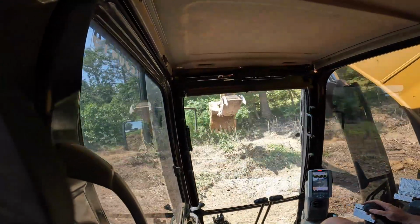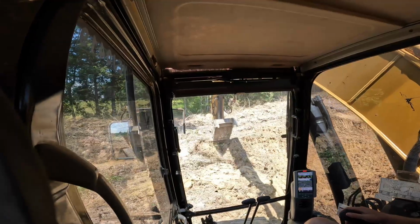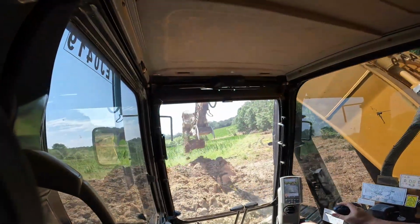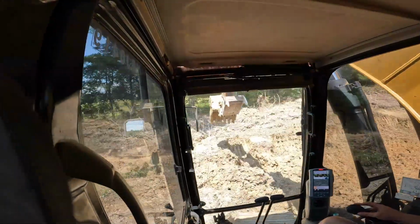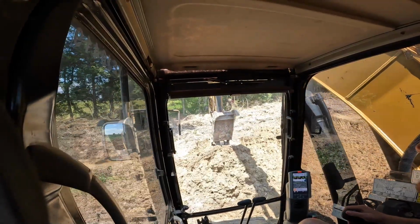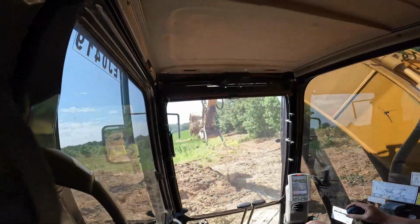Like I said, I built a big build pad for a set of storage units on top of a bunch of that stuff. Just put down some heavy duty geotextile fabric and just went to town. Put a good layer of good dry red clay over the top of it, and it bridged just the best. Proof rolls, compaction, everything we needed to do. So it worked out good.